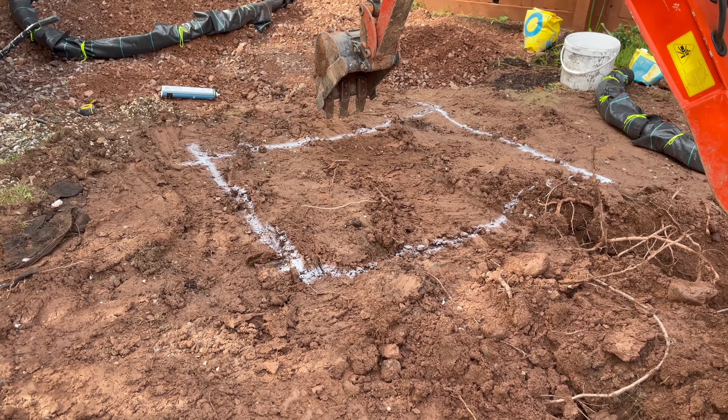Round the corner we've got a sleeper retaining wall and we're going to stick one up against there as well. For now we're going to cover this section. This crate here — we have to wrap that up in a weed membrane as well. These legs at the bottom, that's the bottom of it. So we chuck down 20mm clean stone first, stick the crate on top so no sediment can settle at the bottom. There's going to be a patio behind it, and all four channels are going to lead into the soak away. There's going to be a sleeper boundary wall and we'll stick another one along that edge to connect in as well.